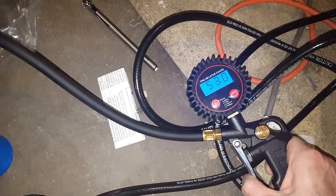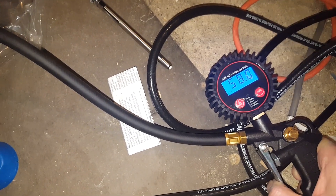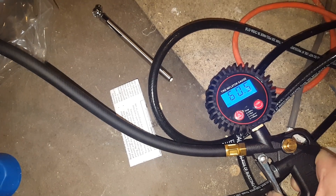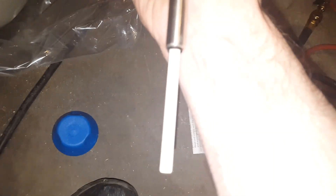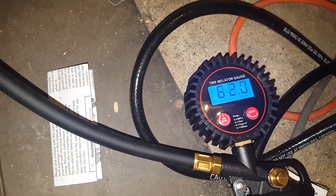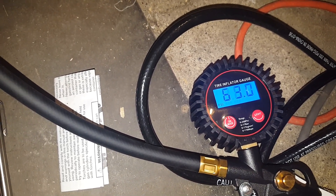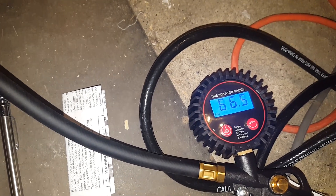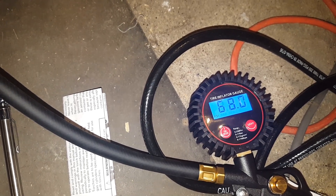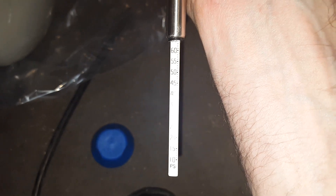It's set too low — so here we go. You can hear the air going in. I'm going to 57... 63. This thing's reading 55, so that's no good. So I'm going to try to go a little higher in case this gauge is off — I can always easily remove some air. I also could have lost a lot of psi when I took the piece off. This has to be over 60. There we go — this thing is pressurized. Put the cap back on.